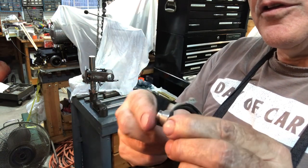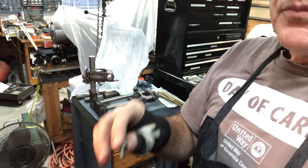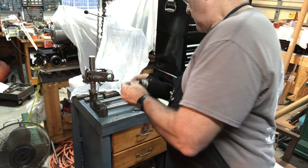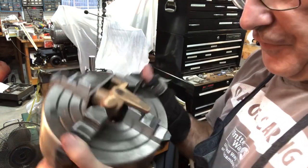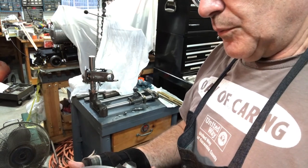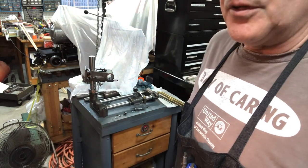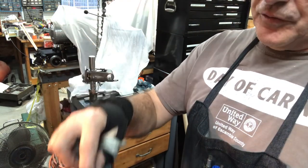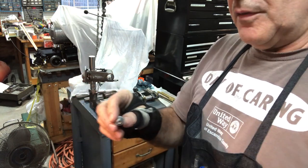The stub is just under 3/8 of an inch, with a quarter inch protrusion, threaded 5/16-24 on the back. I've already got the tilting bracket in a four-jaw chuck. The first phase of machining will be in the four-jaw chuck on the lathe. I'll put the hole through the center where the black mark is, then cut the 20-degree cone. I'll need different clamping methods when I flip it to the other side - my idea is this stub part will fit inside the machined hole, so I can thread a piece of steel or aluminum stock to support it for subsequent machining.